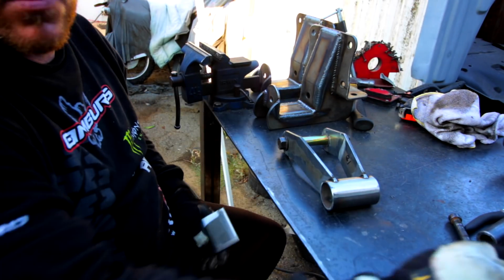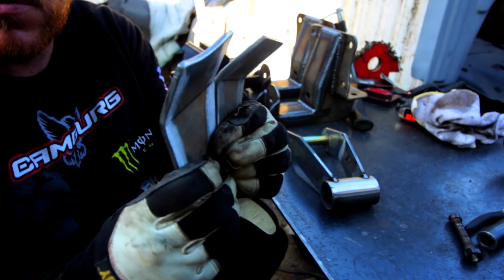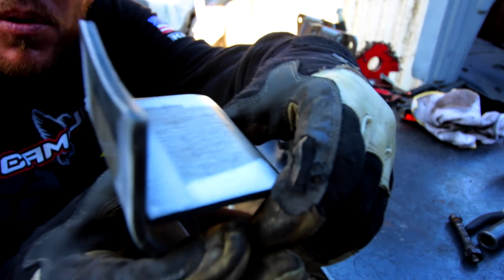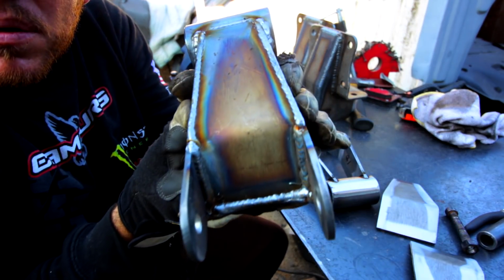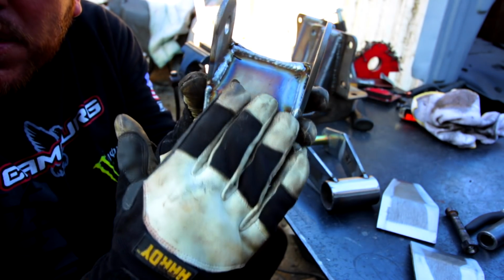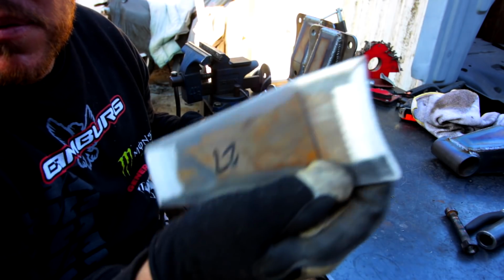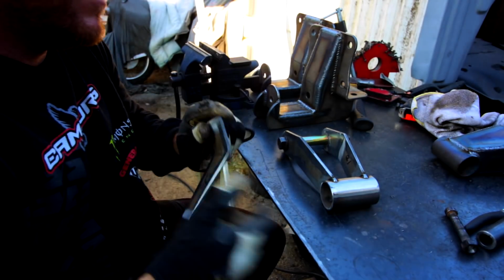So I've got two plates for your shackle and there's two angles. See the difference? So basically one plate goes over the very top of your shackle, the other plate folds in like this, and in the end it looks like so, if I don't burn my hand. So top plate, bottom plate folds into the top plate, welds all together. Tommy, cool enough. You put it on there. I mean, you can figure it out pretty quick, but 27 degrees, 45.